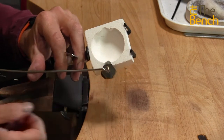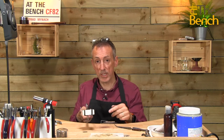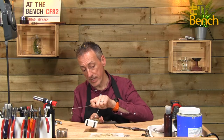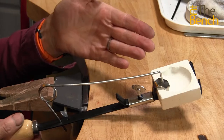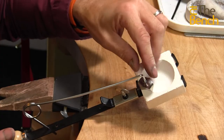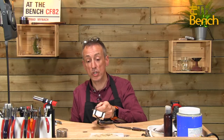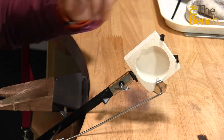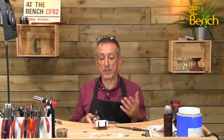Push it all the way or half the way down and that's going to give you a nice lot of tension. Then put that claw over the edge of your crucible - you may want it that way or turned around so just one of those teeth is coming down into place. Because of the spring incorporated here, this is pushing the crucible into the frame, so when you come to tip it the crucible is not going to fall forward. You may want to bring it down onto the end here, but be careful your metal doesn't get onto this steel part and get stuck.